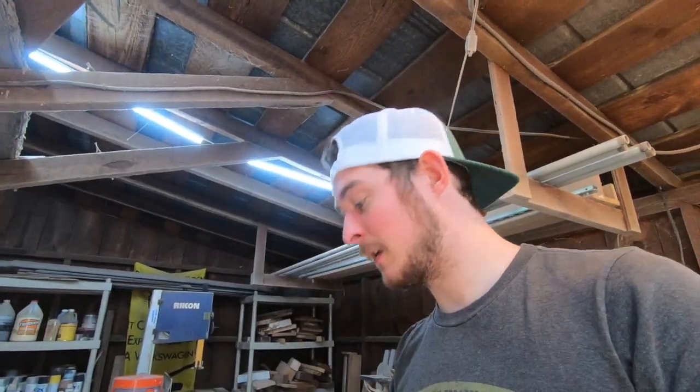All right, we're gonna let that dry. We're gonna let that set up. The bottle says clamp it together for 2 hours. Full cure is in 24 hours, but we'll clamp it together for 2 hours and come back here and true it up.